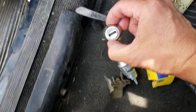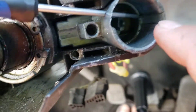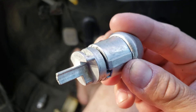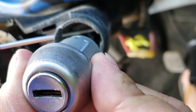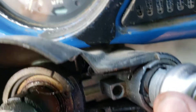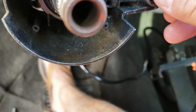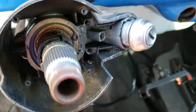Put the old one down, pick the new one up. The way you replace it: there's a keyway, a slot right here, so this will only go in one way. You find the back where it has it - right there on my thumb - line that up, just like that. Line that keyway up to that slot, just like that, and once you have that lined up you work it. Take your screwdriver out, the keyways are lined up, and it falls right into place. It's got a little bit of a tight fit.